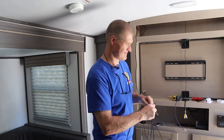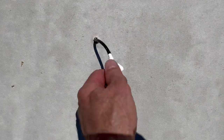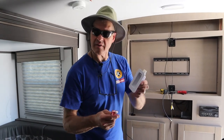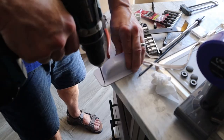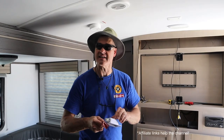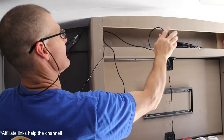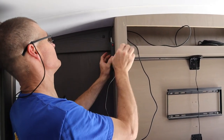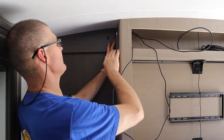Next, we're going to fish our cable through the hole for our antenna. We got the cable through the roof. Now, on top of the roof, we're going to use this entry gland, so the cable is going to go up through this. I'm going to drill four holes and use stainless steel screws. I'll put affiliate links to this and all the products in today's video in the description below. The wire from the antenna comes in the top, and the other antenna that comes up goes on the inside — this is how we're going to mount it. We'll probably use some double-sided sticky tape and put it right there.